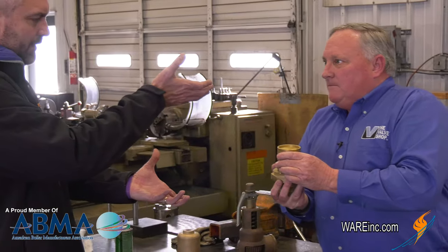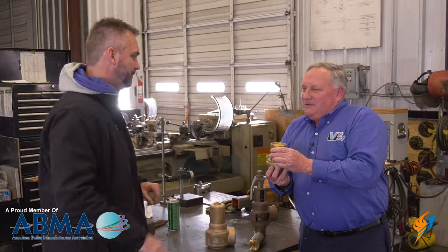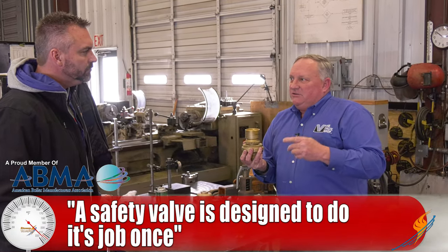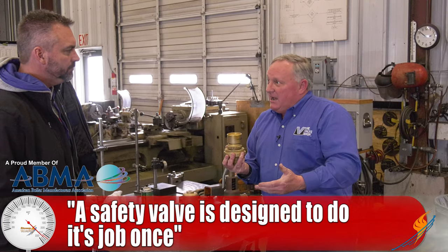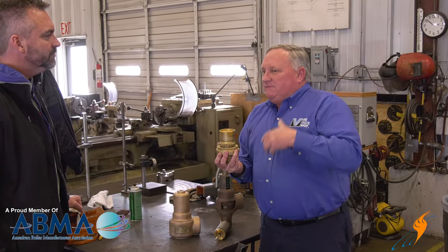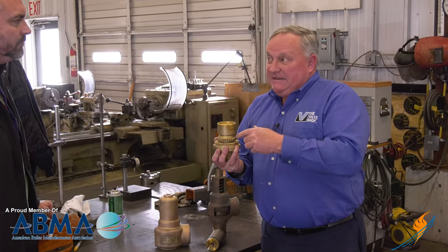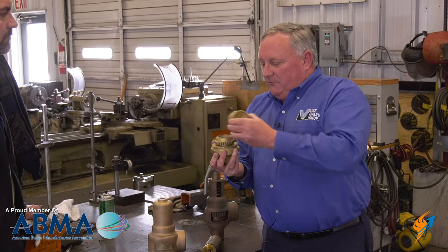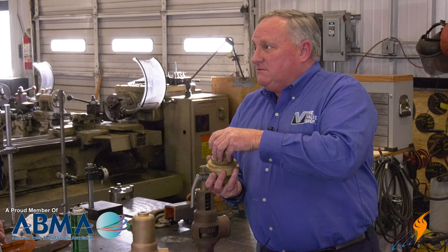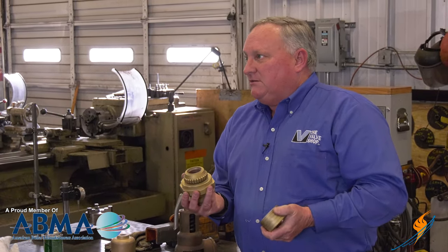When it pops like that, can you just keep popping it? The adage in the industry is that a safety valve is designed to do its job once. Once it's relieved the overpressure, it's done its job. It's a very good idea — when you know it's lifted — to go check if it's leaking by. It's very common for dirt, scale, or whatever to get caught between the nozzle and the disc. If that happens, it will continue to leak and you'll eventually ruin the valve.